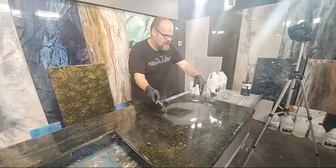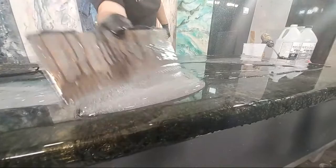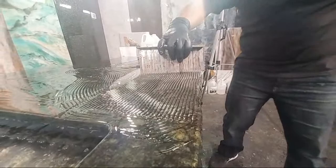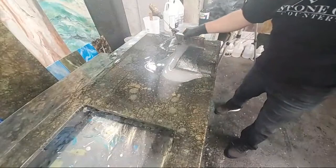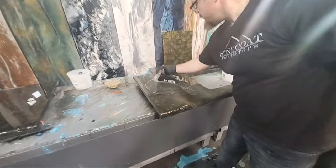Now that I've got that mixed up, I'm going to trowel. I'm not going to push any material over the edge — I'm going to stop a little short and just trowel this out. This is just like applying thinset; it's really quite easy to do. I'm just pushing that right up to the edges. All this excess I'll scrape back into my bucket and use it for the backsplash as well. Notice I haven't started on my edges yet, but I am scraping some off over those edges — that's going to give me my material to use my hands to scrape all on those edges.